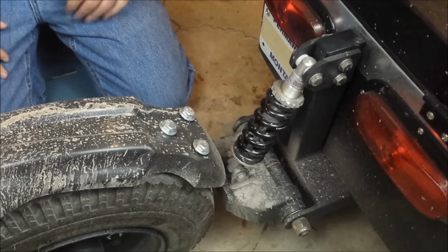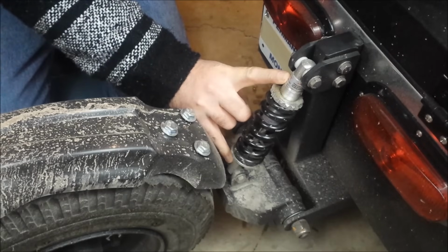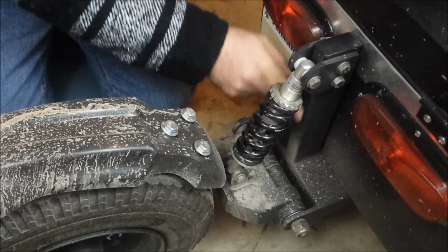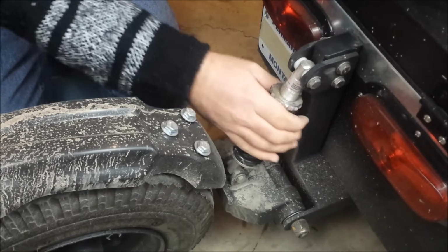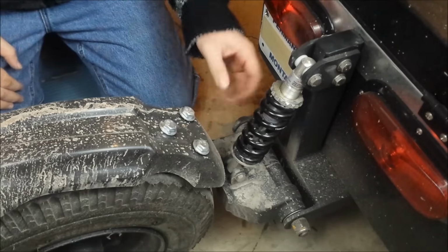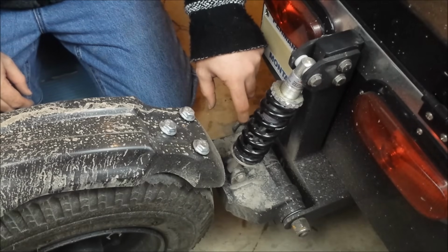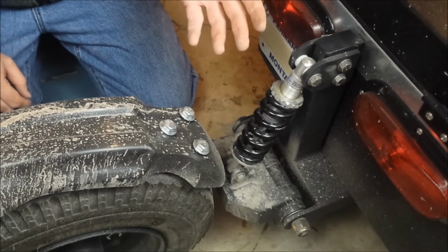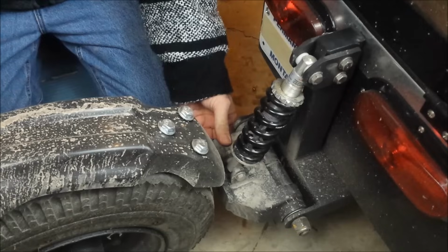Okay, so this is the rear suspension assembly here. This is an 8-inch shock here. I'll put links in the description for that, of course. And this is a 1x2 tower, is what we called it. And it's got a couple plates on both sides. I did have to use some shims on either side of this to make sure that it stayed in there really good and tight. This rear assembly right here is made just like the front part. So you've got the wheelbarrow bearings inside there along with the same shaft. It's basically the same detail that the front ones had, only it's just longer. So that this actually rotates very freely.